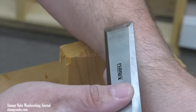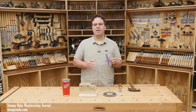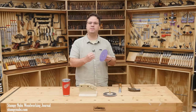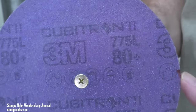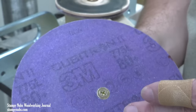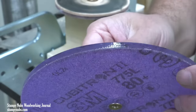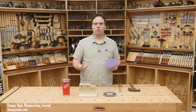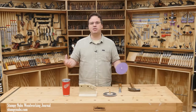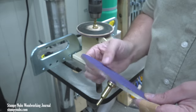The key is not really the discs or the strops, although those are essential, but what really makes this work so well is the sandpaper. It's not regular sandpaper. Regular paper is covered with randomly shaped bits of grit, like tiny pebbles. This sandpaper is covered with tiny, precisely shaped ceramic pyramids. Those cut and shave material more efficiently, so they build up less heat and they stay sharp a lot longer. I've used radial sharpening systems before and they work fine for the first chisel, as long as you're careful not to overheat them — but when you get done with that first chisel, you're changing the paper. The average woodworker, though, can keep his tools sharp all summer long with one of these Cubitron discs.